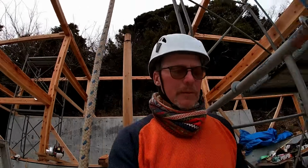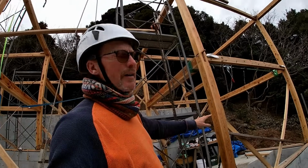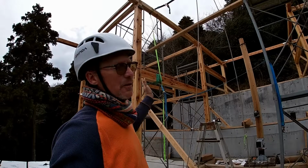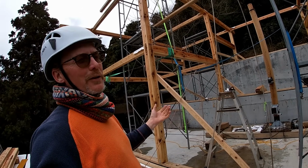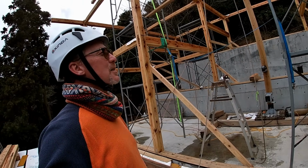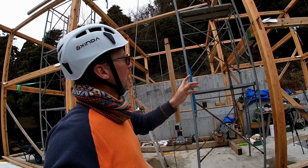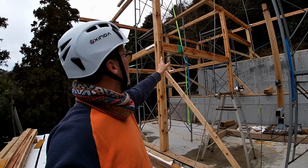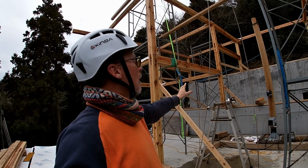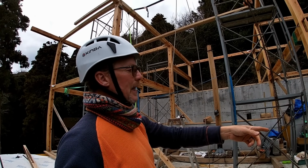So I haven't solved the lifting problem yet, but the length of the girt problem, I've loosened everything that I think is safe to allow these 2 bents to flex outward. The only other thing I can think of doing is detaching the diagonal supports from the 2 end bents. I guess I was thinking that's just too much of a risk, destabilizing the thing, but we still have the 2 back diagonal supports on all of these bents attached. And so if we want to flex this front plane, I probably can detach them.